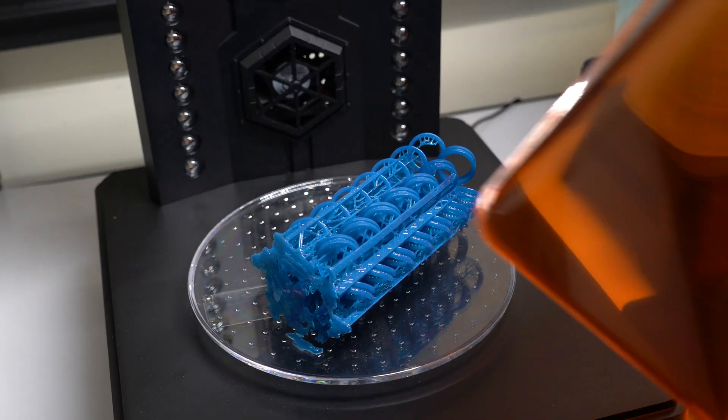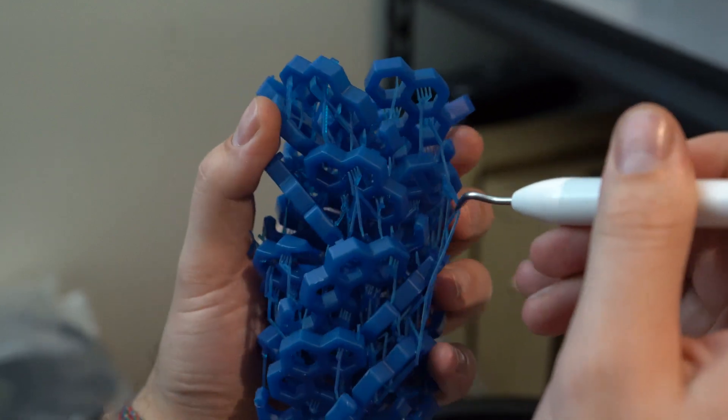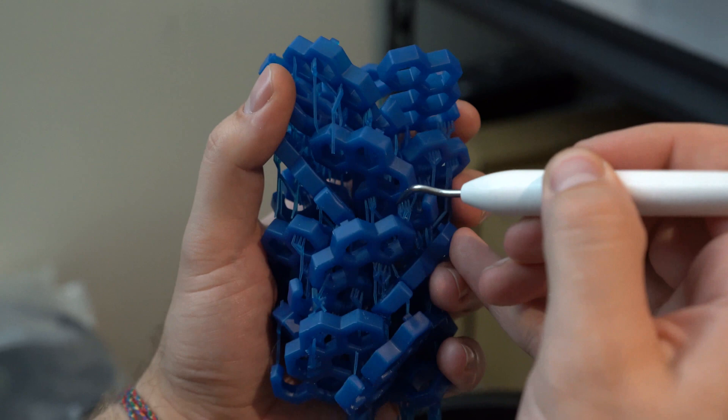Once washed and cured, the three remaining pieces of advice for actual support removal are as follows. First, preheat your tree — you can use hot water or hot air from a heat gun or blow dryer. In our case we're using ApplyLabWorks Cyan, and when heated, Cyan takes on a slight flexibility which is awesome for taking off supports. You might need to experiment with the amount of heat depending on the resin, and remember that these are castable materials, so make sure it's not too much heat because they might start to melt or burn. Next, I borrowed some tools from our Cricut setup to get into all those little fine details — I try to avoid putting supports inside the tree whenever possible, but this tool helps get into those little areas and pull those supports out really easily. You might also want to use a dental pick or an old-school wax carving tool.